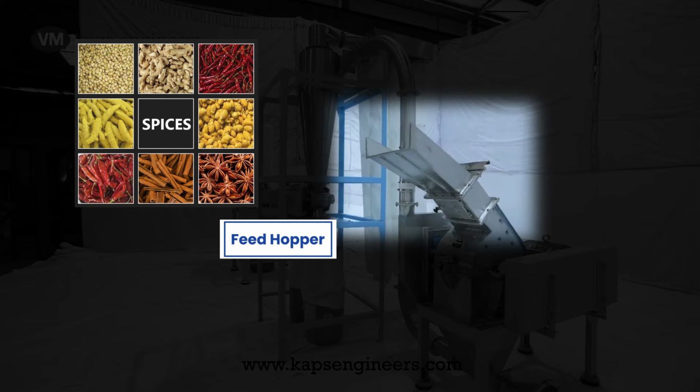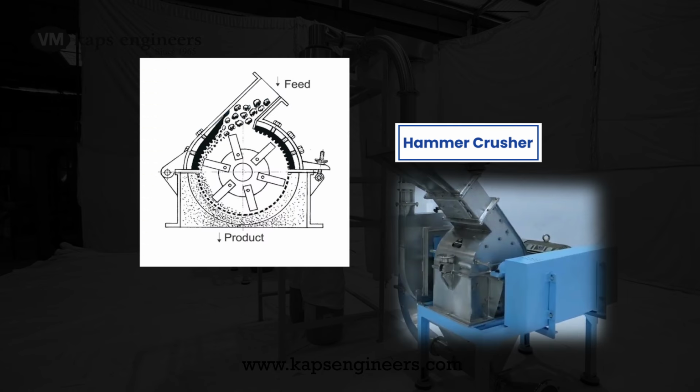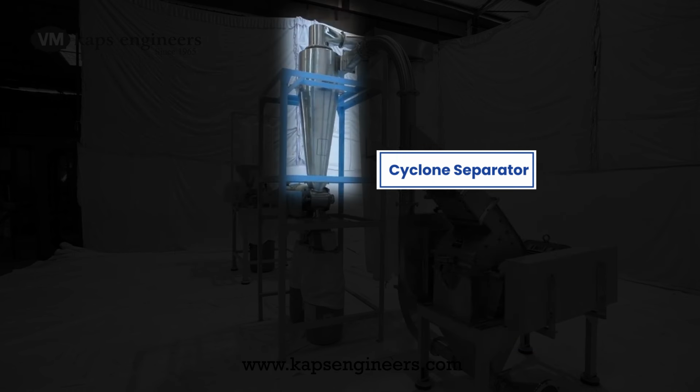Feed material is fed to the hammer crusher mill via a feed hopper uniformly as the first stage coarse grinding mill. The hammer crusher is a screen-type equipment where grinding takes place between hammers and liners inside the mill, and material is discharged through the screen. The role of the cyclone separator is to separate air and material.